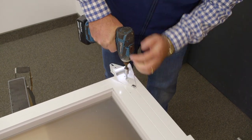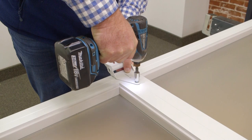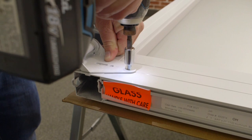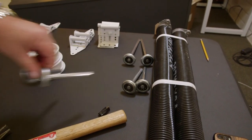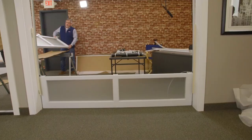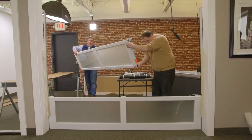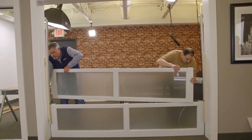Repeat the same steps with the next door panel, but this time with the number two hinge on the sides and the number one hinge in the center. Each consecutive panel will require the next number of hinge, but always keep the number one hinge in the center. Once the hinges have been attached and the rollers are in place, you can feed the next panel through the track and screw the hinges in place. Repeat this step for the remaining door panels and continue to feed the tension cable up past the rollers.